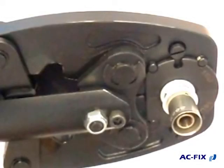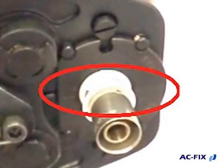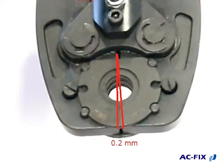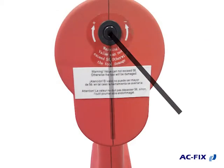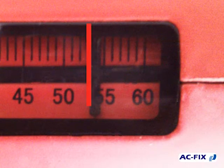Be sure that the gap between the inserts is less than 0.2 mm when the tool stops. If the gap between the inserts is more than 0.2 mm, turn the screw clockwise as shown in the image. Remember that the maximum value can be no more than 53.